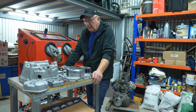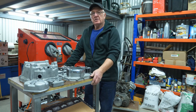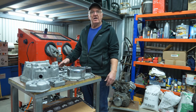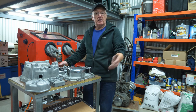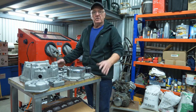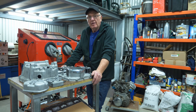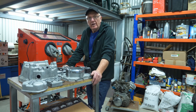When you finally go to start your wet blast cabinet, don't be in a big rush to throw the media into the water and get going. Put your water in and probably add about two cups of media, then run your pump for about five minutes. Stop it and just see where your media is settling within the tank — it's a good way of checking before you get started.